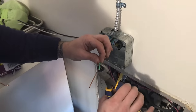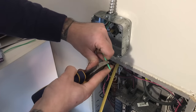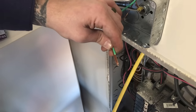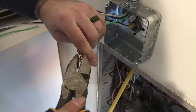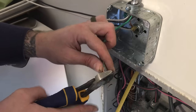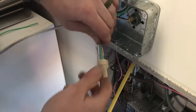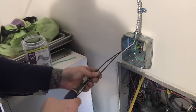We've got one sheathed and one unsheathed because we're using different wires. I apply a small amount of pressure to a part, turn it, apply another pressure, turn it, and move around again — that's how I strip that. With wire nuts, a lot of people will just hold them together and add the wire nut and screw on. I'll be twisting them together with my side cutters first. We twist them, then see they're at different lengths, which will make it harder for the wire nut to connect, so we cut them to the same length. Then we twist our wire nut on, making sure it's good, and give it a pull on both sides to make sure the connection has been made. That's ground to ground. Do the same again with live and neutral.